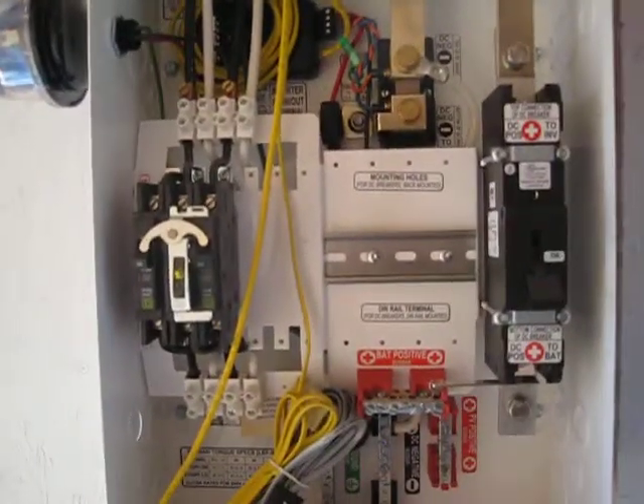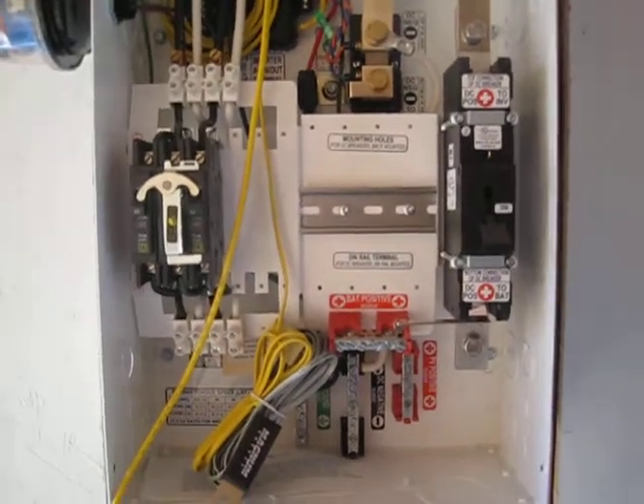I'm going to give you guys a look inside this inverter so you can see all the stuff here. There's your PV, there's your DC and your ground. Again there's your inlets and outlets — your inlet on the far right, that's if you have like a generator or if you had it hooked to your sub-panel in the house. And then your AC out, neutral out, which will go to your sub-panel.